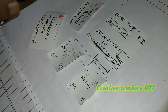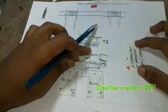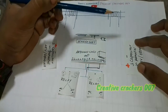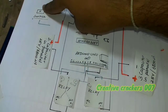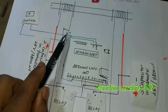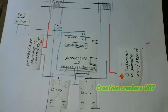To supply the 25 volts, we are choosing a capacitor of 25 volts and 6800 microfarad. Join the positive of the capacitor to one end of the coil and the negative to the common pin. Do this for both the relays and capacitors. Join the NO pin to the remaining end of the coil. This completes the final circuit. Now we have to add a switch to control this process. Join one point of the switch directly to 5 volts and another part via a 10k resistor to ground, and in between the 10k resistor, join a wire and connect it to pin number 2.